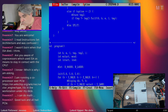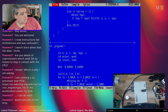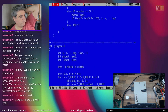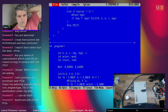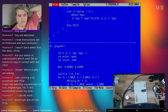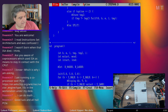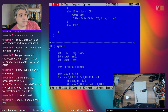So what's the future then for this? Obviously I'm going to enjoy using it. I'm probably going to set this up permanently in one of my older systems, either the 486 or possibly my Cyrix, which is permanently connected under the desk. I've got some DB25 connectors coming. They're IDC ones, so no soldering needed. Just crimp it onto a bit of ribbon cable. Should also be a bit more flexible than the really chunky, thick cable you get on this, which is nicer. They're coming from China, though, so that's going to take forever to get here.